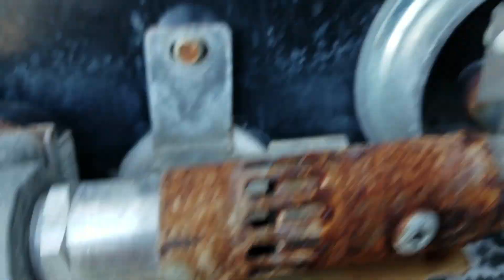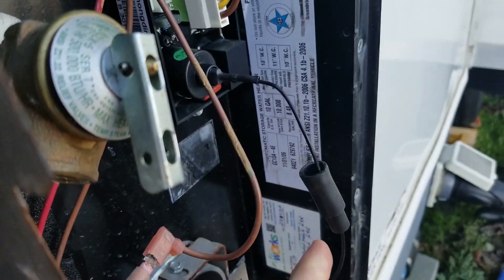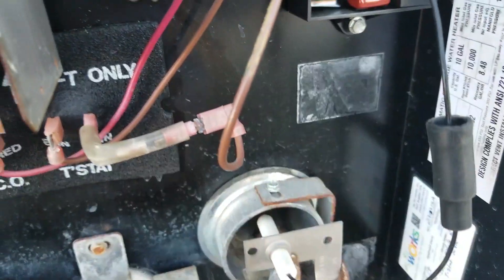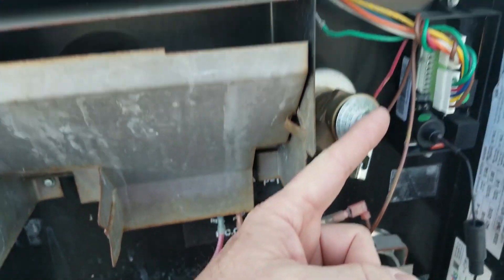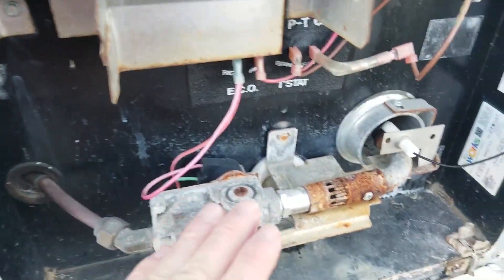I hear gas, but I have no ticking sound and I have no ignition. When you have that, make sure all the electrodes are connected correctly — which we've already done. It'll try three times. Second time — I can hear the gas, and I'm actually smelling that ethyl mercaptan smell right now. So we know the gas valve is working, the module is energizing the gas valve through this red wire, and the ECO is working.